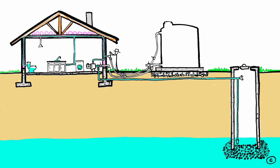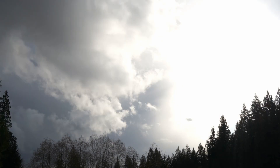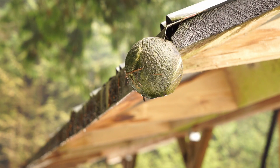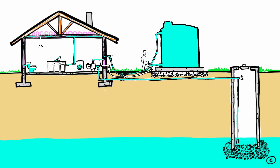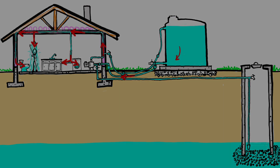The plan is to slowly collect water into the tank by trickle feeding it at a rate no greater than the well's recovery rate. I don't have a meter for measuring this rate, so I estimate based on my experience with this well. I start collecting water earlier in the season, using it to supplement the water supply in drought season. Whenever I need more water than the well can give, I switch the supply source to the tank by turning on and off a few valves. Any other time we are not using much water, I continue trickle feeding the tank, such as at night when we are asleep. This process repeats itself until the drought is over.